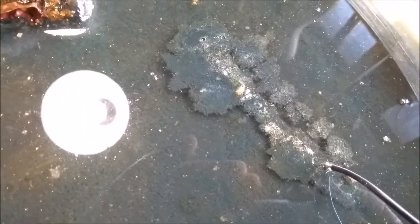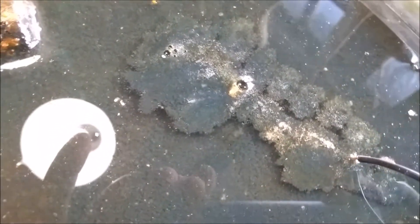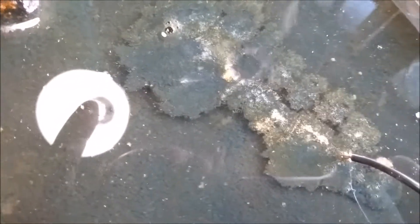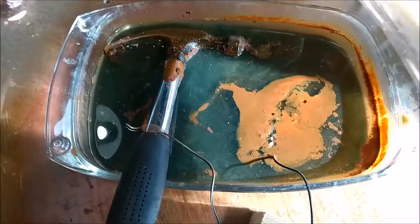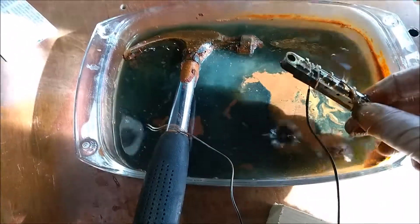Just to show you what it looks like when it's working — you can't actually see the bridge because there's so much dirt in this salt solution now that it's not visible. But there it is, bubbling away. What's happening is that the current passing from here over to the hammer is dragging all the dirt and muck off the metal bridge. So let's see what it looks like when it's finished. I'm going to take it out now and we'll see how clean it is.